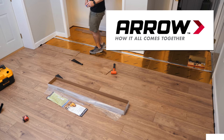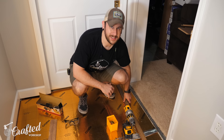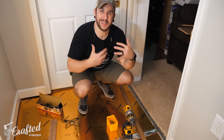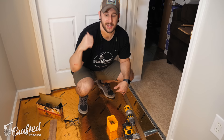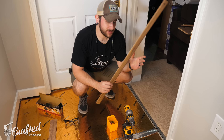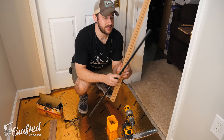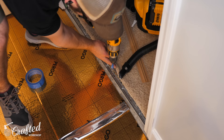I just kept installing flooring until I got to my next obstacle: a transition. Now I've got the flooring installed up to the first doorway where I need to add one of these transition pieces. The other doorway already has a transition going from the air-conditioned space out into the garage with a weatherproof and insulated strip. But here we're transitioning from this laminate flooring to carpet, and behind me going into the bathroom I'm transitioning from laminate to tile. I've got these matching transition strips — I cut them to length with the miter saw. The other piece that comes with the kit is this metal strip that connects to the subfloor, and the bottom of the transition has a little piece that fits right into this strip. Once that's in place I can install the rest of the flooring and add the transition piece when done. I attached the aluminum transition track and then continued installing the flooring, needing to know what length the boards needed to be in this area to leave the correct expansion gap.